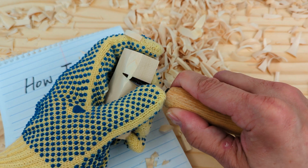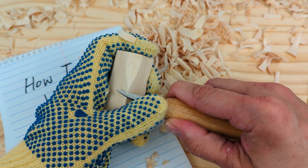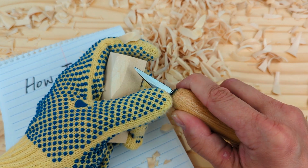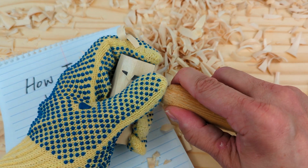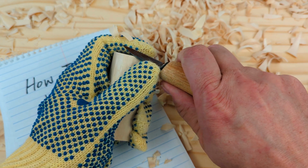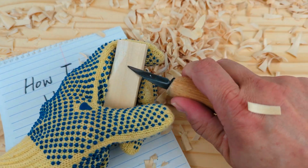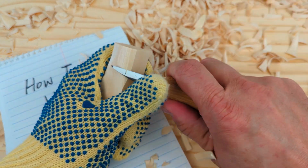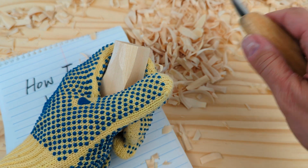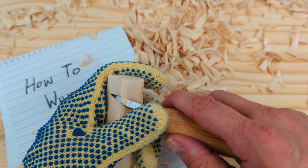What that does is I can really control how much pressure and how much counter pressure I have on that knife to make sure I'm making a nice controlled cut. I know exactly where it's going. My thumb is pushing it through, and on my right hand, I can give some counter pressure, and that keeps me from flying off the edge like this. I always say it's not peeling potatoes. You're not peeling potatoes here. If you're doing this, who knows where the knife is going to go, who you're going to cut, what's going to happen. So I want to make controlled cuts.